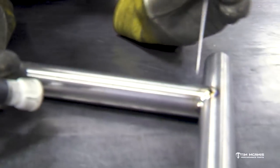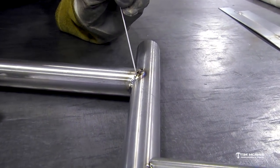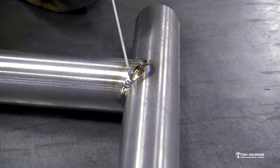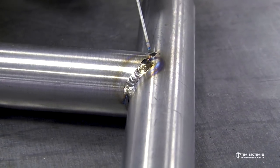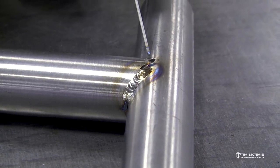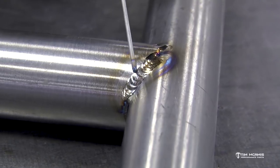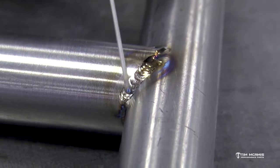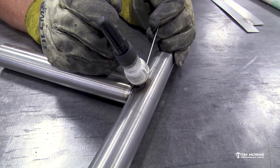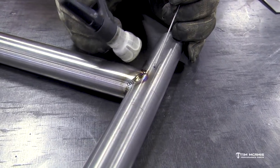You can see I've got some good coloration in there. It's got that little bit of nickel color to it, maybe a slight little bit of gold color, which is fine — it's normal when you're doing tubing like that. One thing that's nice about this titanium is you can pick right up here and pull that on around and you won't even be able to tell where you started and stopped. You can see by the tube there's not a lot of heat in the tube — it's really covered pretty well. I can go right in here, pick that up, start and come around this corner and do about another three-quarters of an inch and then come back this way.